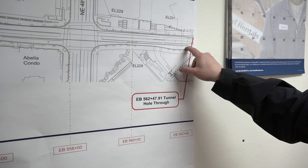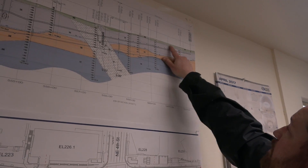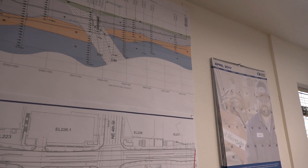At the north end of the tunnel, we had a ground improvement effort. Atkinson went in and replaced all of the soil above the tunnel with what we call CLSM — controlled low-strength material. The reason why the ground there is a little bit loose is that a lot of utilities went in over the years in that area, which caused us to have to do the ground improvement.